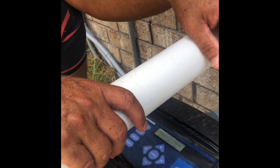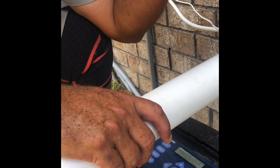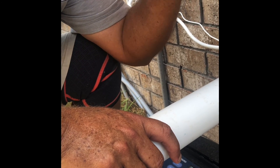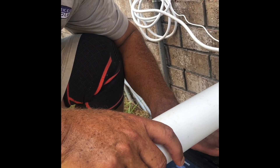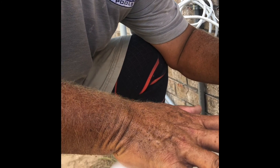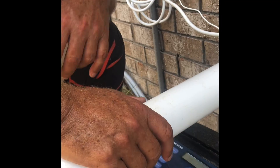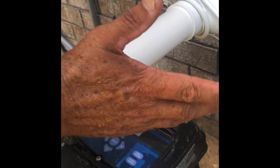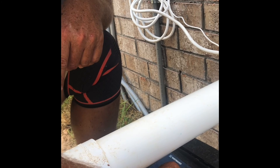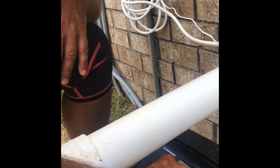Now we can go to timer two. Do you want it to run 24 hours? If you do, we can have it come on at 6 p.m. on a different speed and go down to like 1,500. It'll still keep your water generating, but this thing is going to go way down. Or we can turn it off. Your chemicals are great. Everything looks good. So you can set up all kinds of different times on here.